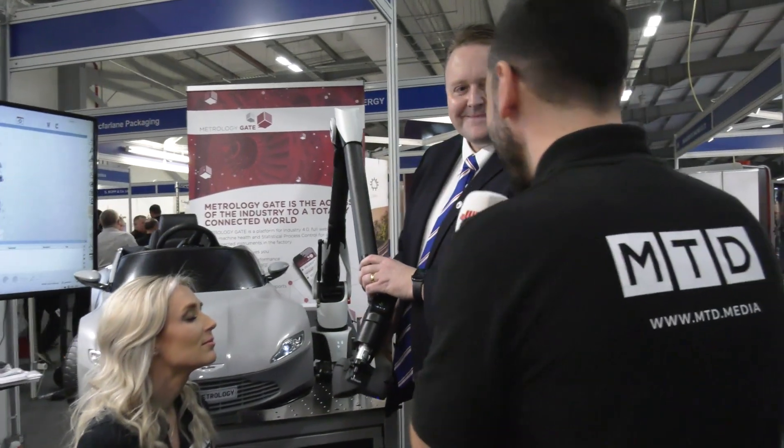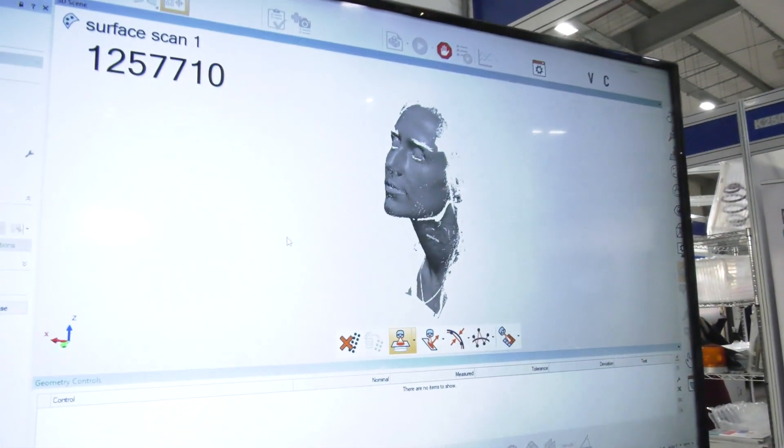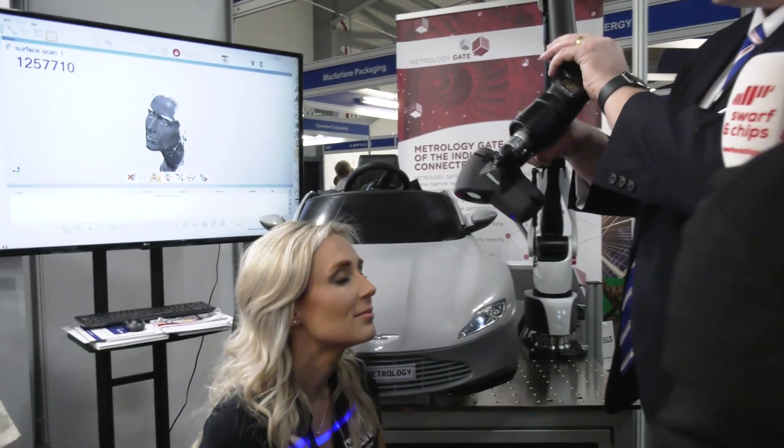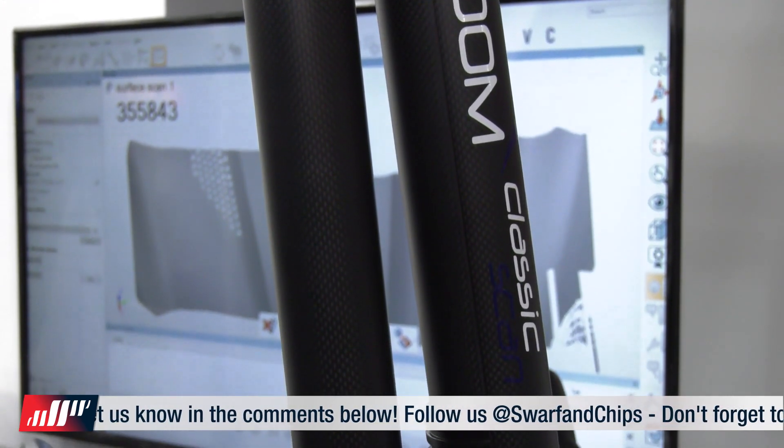New for this show, they've launched the new Freedom Arm — a portable CMM. With the laser scanning attachment, it can capture up to half a million points per second — what better opportunity than to scan Lindsay's face? Applications in engineering include use as a traditional CMM with probing for prismatic parts, but scanning opens up the market totally differently. Arms go up to four and a half metres, so you can imagine having this on the side of a vehicle to scan the full side of a car — all those sheet metal parts can be quickly and easily compared to CAD. Also, if you've got a part on the machine tool, you can take the CMM to the machine, put it on the machine bed, and do a quick inspection to make sure everything's good, because it's always very difficult to re-align a part back into the machine if there's a problem.